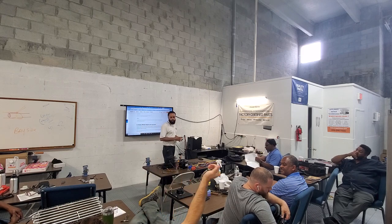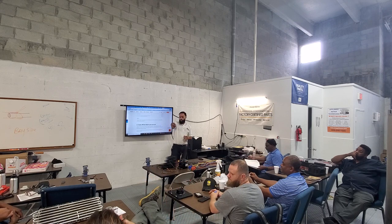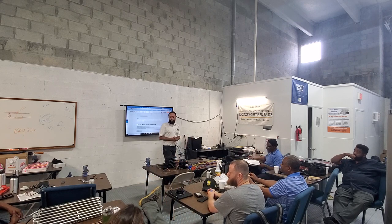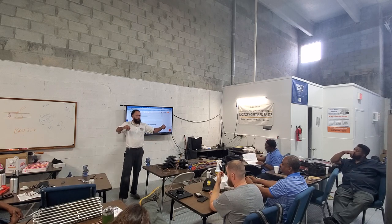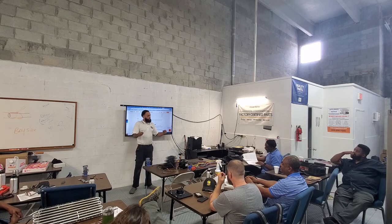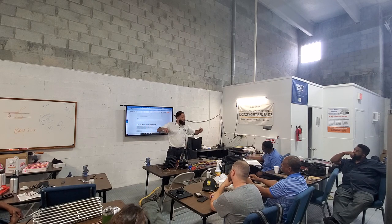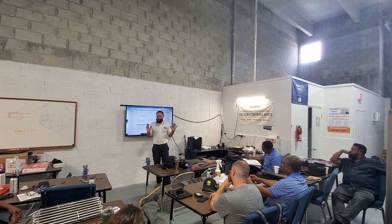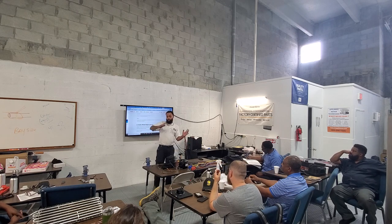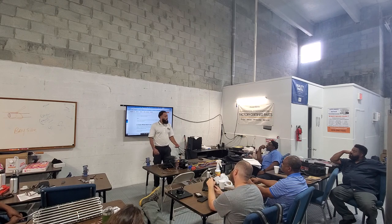To the refrigerant is coming from the evaporator. Is he right or wrong? Correct. Okay, good job. So we took our two lines out, right? Now, these compressors have little apparatuses on the actual lugs themselves. They're held on by screws, bendable clamps, tabs, whatever kind of nonsense. That's just in the event that if the fridge tips over or anything, the compressor don't go flying all over the place.